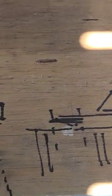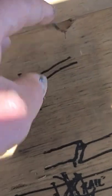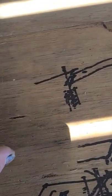So I think that covers it for today. This is how to make a splice, and you can use it for your baseboard, your exterior trim, anything like that. That's the other thing I was going to tell you. If you're doing interior trim, you'll see most guys just do the one row of fasteners, one, two, or three, depending on, you know, the height of your baseboard and if you're catching a floor plate or whatever. Usually just two or three, though, in a line, straight up and down, and they're just doing it on that one stud.